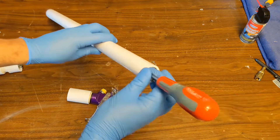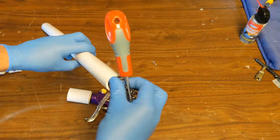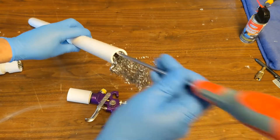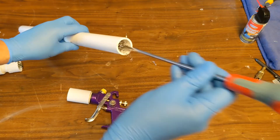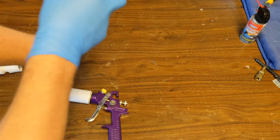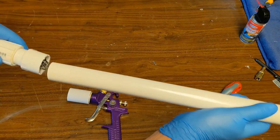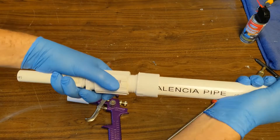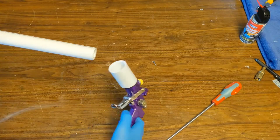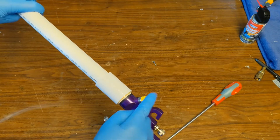Use a screwdriver or a stick to push the material in. Then take Scotch-Brite stainless steel — so it doesn't rust — untangle it and push it in the same way. Don't try to push it in as it comes in the package; it just won't go in. Once done, the assembly is the same as the original: connect these to the output reducer and to the spray gun. Make sure you use PVC primer and glue — it's a primer and a glue — I'll put a link in the description, otherwise it'll just pop off.